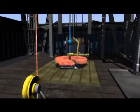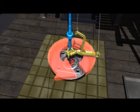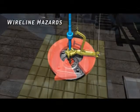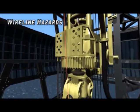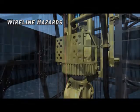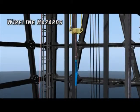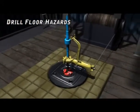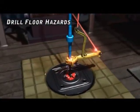In order to make a back off in your drill string, left hand torque must be applied. This can create safety hazards that you should be aware of. The obstruction of the top drive can cause interference with the wire line, possibly damaging the cable. Torque release not isolated by the swivel can cause the wire line, which may be under tension, to wrap up and possibly damage or part the cable. Pipe handling under high torque conditions creates pinch points and stored energy, which increases the risk of injury to the floor personnel.